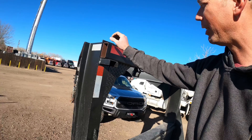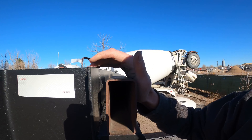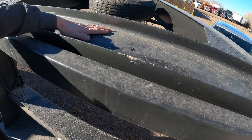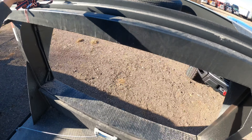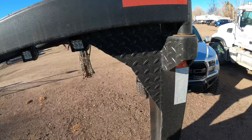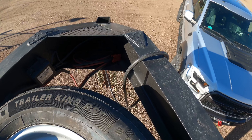This will probably be secured with some kind of pin, but I haven't done that yet because if I put a gantry on here I have to leave space for the plate and the nuts and bolts. It's currently just being held in with a ratchet strap until I figure out what I want to do. When you put metal sideways like this you've got to think about drain holes — got a drain hole there and down there, just in case we're not level and water isn't collecting on the side without one. There's a gusset here and up here on both sides, and fish plates on those bends — plenty of reinforcement.